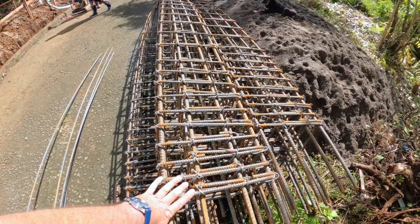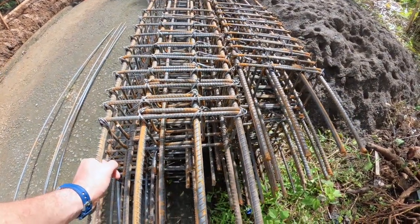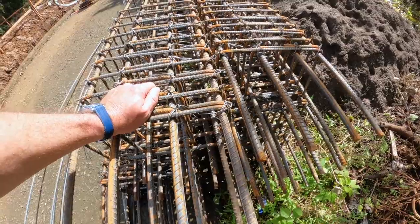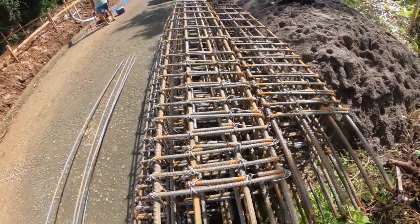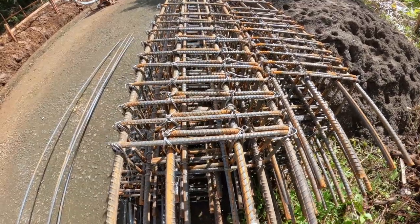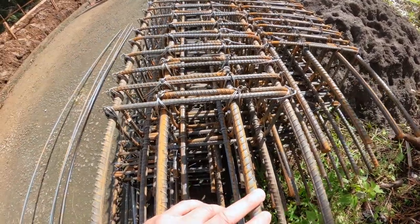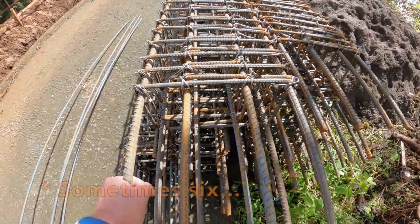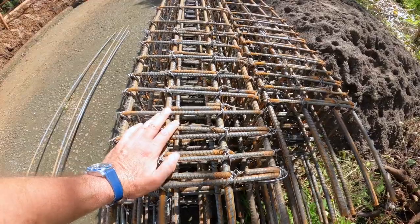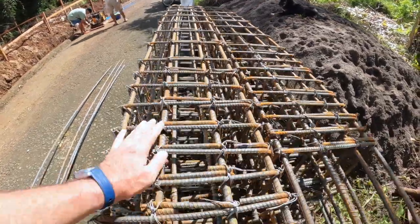Here's what they look like — these are per design normally. It's got 16 millimeter rebar on the outside and 12 millimeter stirrups holding them on. What's different from other construction is the whole center here — this is kind of a double design. Normally you won't see these four with stirrups in the middle; normally it's just four on the corners with stirrups.